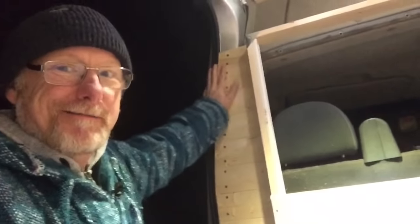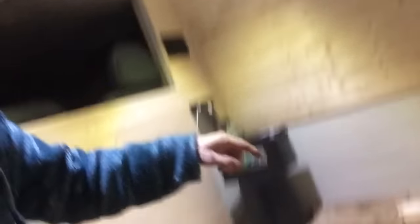No disasters today — this is my progress. I managed to paint the side but I didn't paint the floor because the floor is quite damp. It's been really foggy all day yesterday as well so my floor got a bit wet, and I don't really want to paint over that with an oil-based primer because that moisture will be locked into the wood and it'll cause it to rot or smell. I'll need to dry the floor out before I can paint it. I did manage to finish the bulkhead — there's my control panel up there, boxed in nicely.